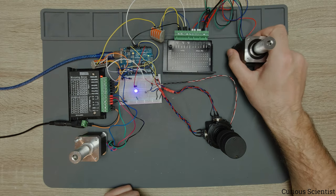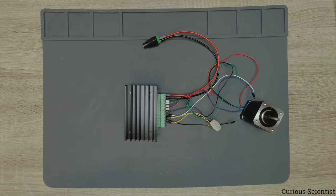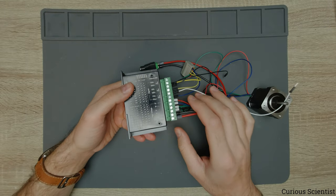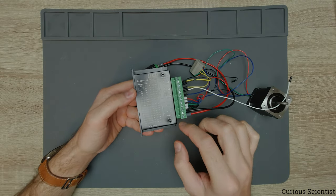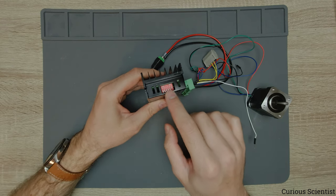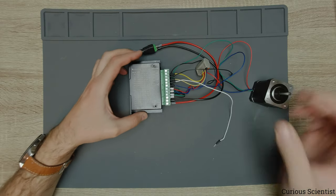I think it's better if I explain how a single stepper motor is wired up with a TB6600 driver and an Arduino. Before proceeding to the deeper details, let's go through the wiring. You can see the TB6600 unit — some units have a plastic cover, this one has a metal sheet. All the information you need is on the surface, including the DIP switches for setting microstepping.